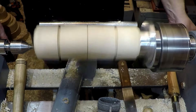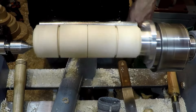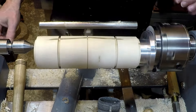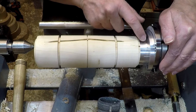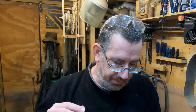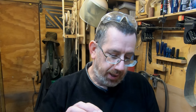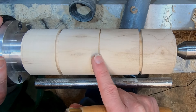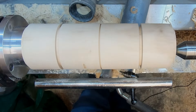Turn the lathe speed right down and bring up my live center for support. At my index position I'm at my starting point. The way the blank is held to the eccentric spiraling chuck is very much like a face plate — it's held in with three screws. Because it's end grain they're not overly long screws, so there is a chance of it being pulled out, which is why I'll always use my live center for that extra support. I'm going to use my ordinary spindle gouge. The idea is I want to take that center point down to the size of the bottom.